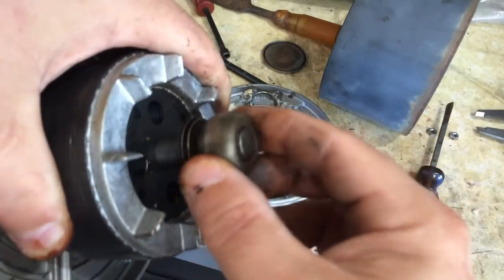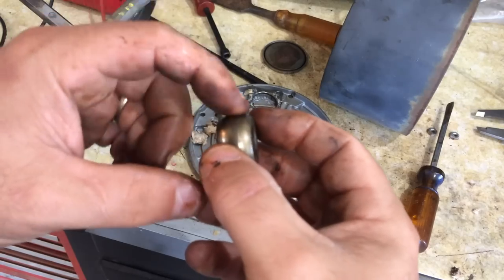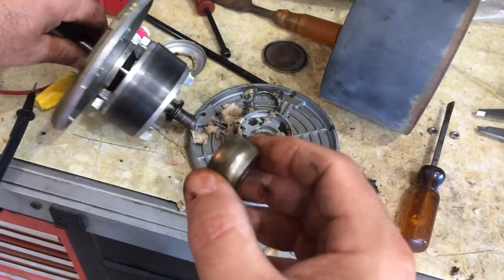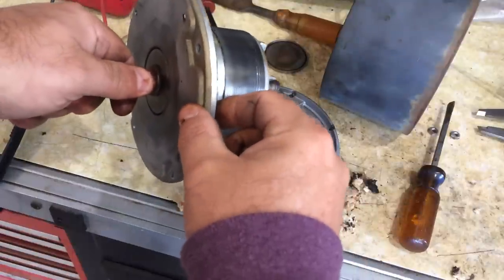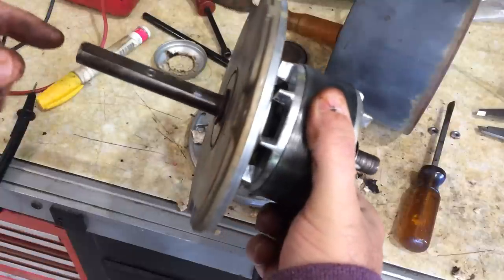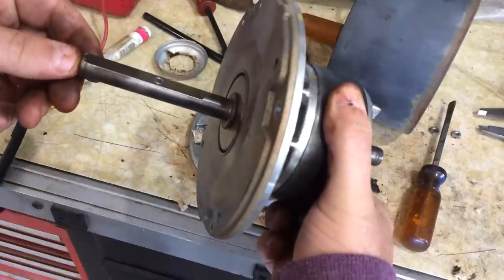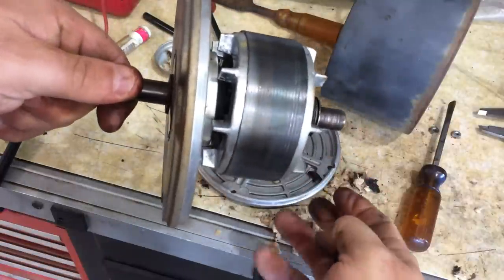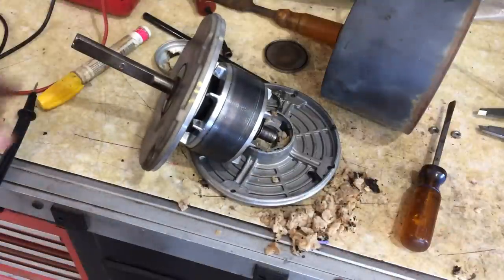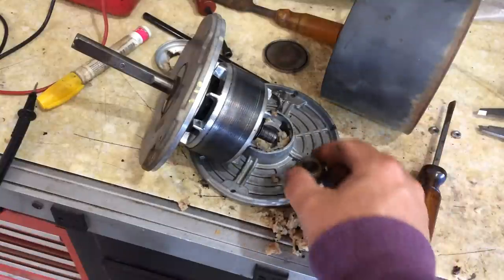I'm going to stop right here on this. Down in the description I'll post whether or not you can order a bushing, because I'm not even sure, but I'm going to try and look this up out of curiosity. By the way, the front bushing should be replaced as well — there's a really slight wobble in there. These motors don't really matter if they have end play, so if it went in or out that wouldn't affect anything — it's just that side-to-side wobble that will make a lot of noise. Thanks for watching guys — let me know if you've ever replaced a condenser fan motor or tried to rebuild one, but from the looks of things this doesn't appear to be rebuildable. Take care.